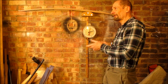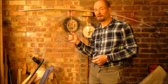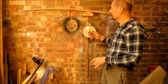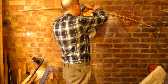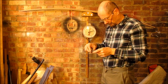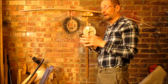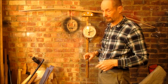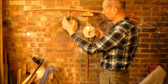If we say it's 60 and we want to take it to 30, I'd actually have to make it half as wide — I'd have to reduce the width a ridiculous amount. I can take the width down a little bit. It's about 27 millimeters wide — not bad. I could take it down a bit more, but taking some off the width doesn't do a fat lot. I'd have to take it down a huge amount — take 30% off, down to 18 millimeters. And then of course it would bend sideways instead of that way.